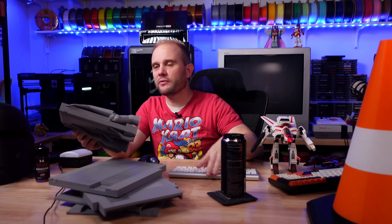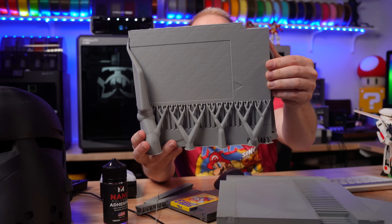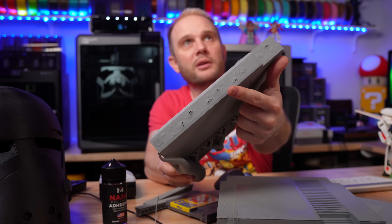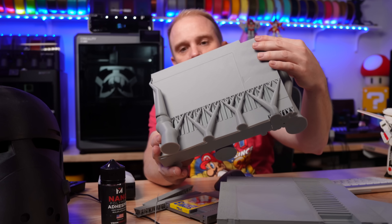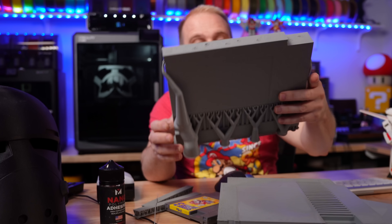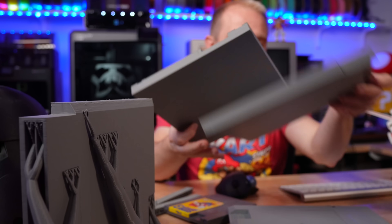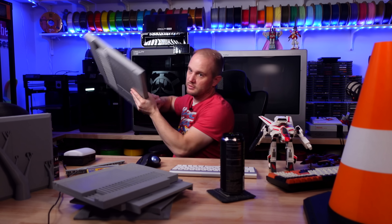So I thought I'd change the orientation, went with tree supports, and I went with Adaptive Cubic infill. Not only did the infill bleed through on the surface, but apparently there was pillowing up on top from not enough support underneath. It had like four or five top layers. So I went through four spools — I have four partial spools of that filament left now — and went through this, and this, and this, and this, and that, and this.